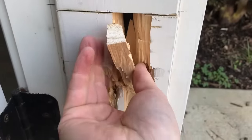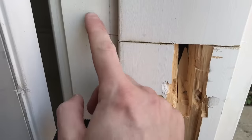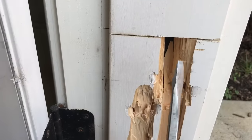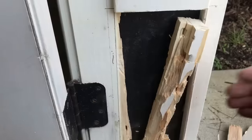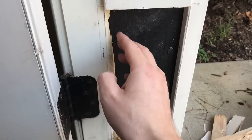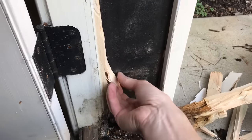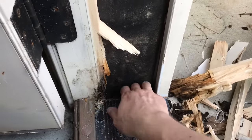I'm starting to crack out pieces of the full lower jamb now. There's a big hole at the bottom and I can feel the house wrap behind it. I'm taking it off little piece by little piece, working my way over to the thinner area where I can cut more cleanly with a knife or chisel. Just go slowly and you'll get this big piece out in maybe 15 minutes. I've got to the bottom — I'll clean up this edge of the inner jamb and make sure I have a good flat surface. The house wrap is in pretty good shape, which is what we want to see — that tar paper acts as a light vapor barrier between the house and the outside. Sweep all that away and you've got your threshold right there in the hollow space.